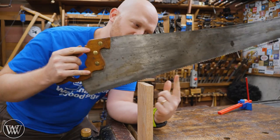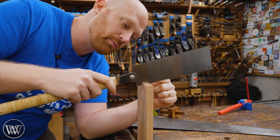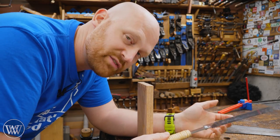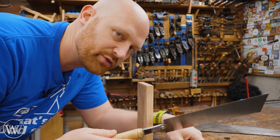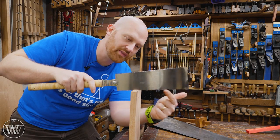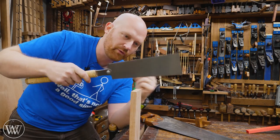Before we go any farther, we need to talk about saw geometry. On a western saw, the tooth is pointing forward — this means we remove the most material when the saw goes forward. With Japanese saws, the teeth point back, so you have the most stock removal when the saw goes backward. You'll hear arguments that one is far more efficient than the other, with good arguments for both directions. The truth is they are both identical — you're both removing wood, and how much depends on the profile of the tooth cut. They're identical as long as the teeth are of similar size. The big difference comes in control. With a Japanese saw, the leading tooth is on the back side — that is the first tooth to engage the wood — and because of that, you have no control over the leading tooth.